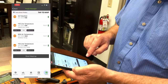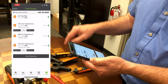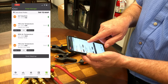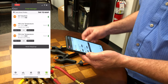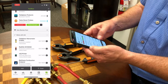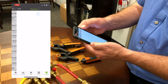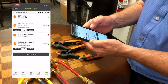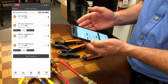If you need to delete a probe, just go back to the toolbox. Power off the probe you don't want — it'll go red — then just swipe it and delete it and it'll be off your system. If you want to reinstall it, power it back on, go back, hit plus Add, Testo Smart Probes, you'll see the 905, click on it, hit the back button to Probe Manager, and once it comes in you can map it back to outdoor air. That's all there is to it.